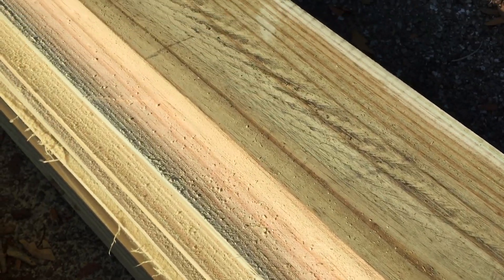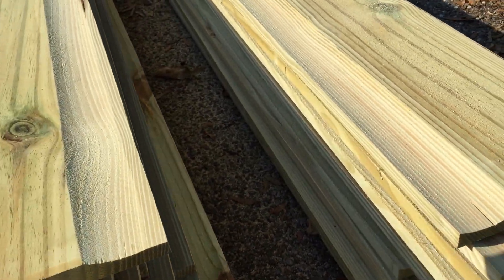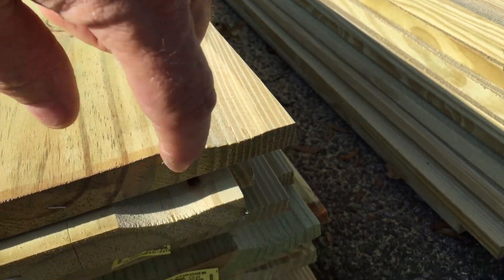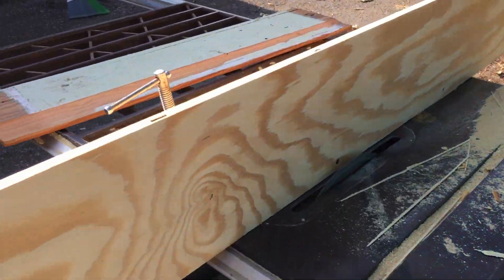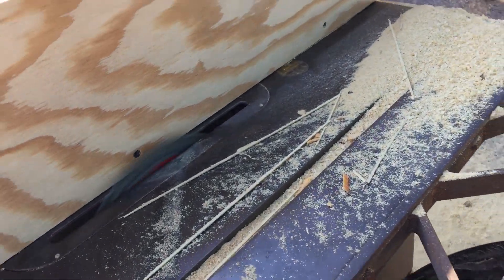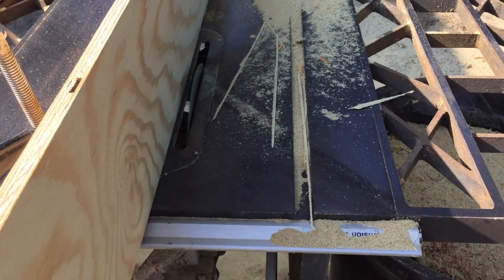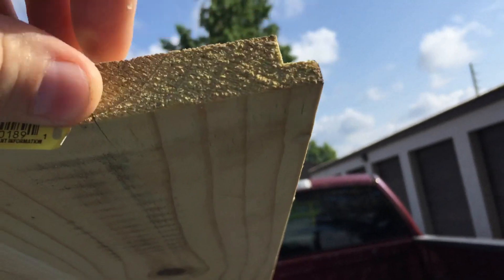This is the result of running them through at 45 degrees. The next step, once we get this milled out, is we need to take this little high spot off. We run it through the table saw to take that little bit off — you can do that with a router, but unfortunately I don't have one to work with right now. So we've got this tall rip fence we built, set the depth of the blade and the spacing, and just run them through to take that little tip off. And there we have the finished product: we've got our cove cut in right here, and we've got our rabbet on the back side so it's going to overlap up on the top.